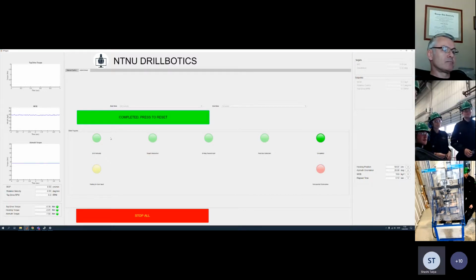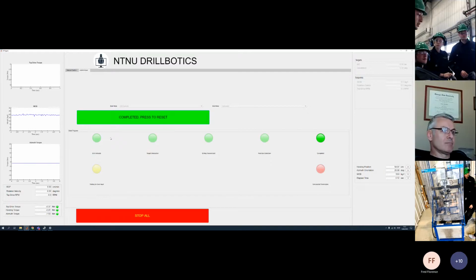This is nice. Good job, team. Thank you. One of the things that I'd like to see is a photo taken from the top after you disassemble the rig and move it away from the rock, and just see, is there any spiraling in there of concern? Yeah. The vertical part, it's not so spiral, but you can actually see it's a little off gauge, of course, because we're drilling with an eccentric bit. So it's a little off gauge. Yeah, we can show you that. Well, you're going to get a paper out of this, so that's why you need those photos. Oh yeah. Okay.